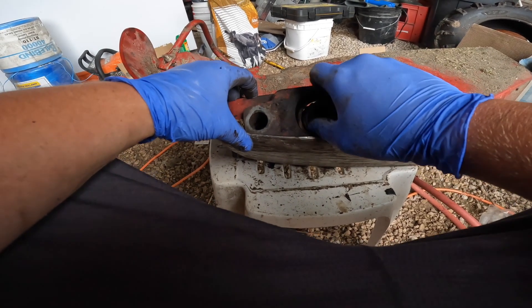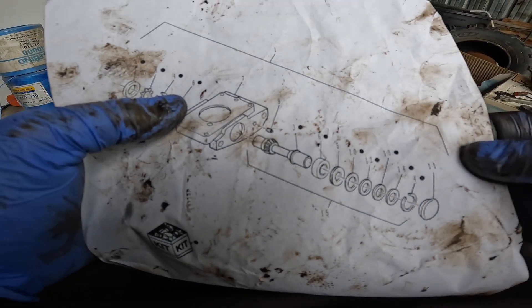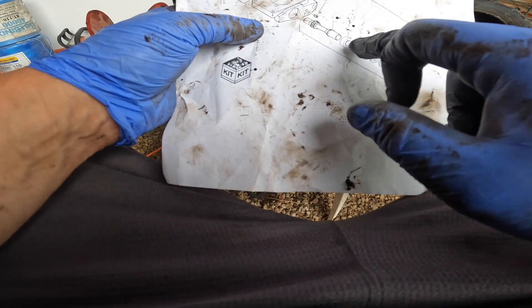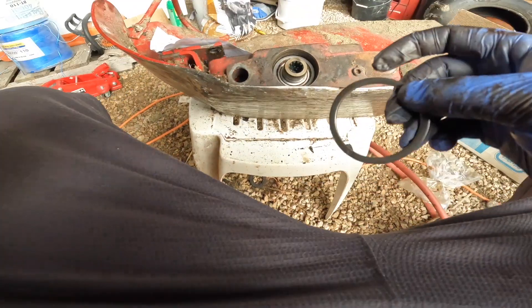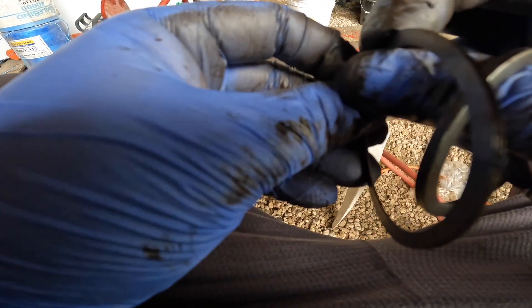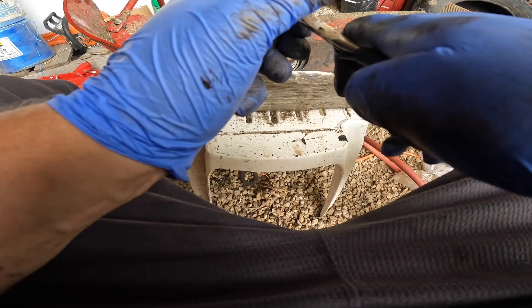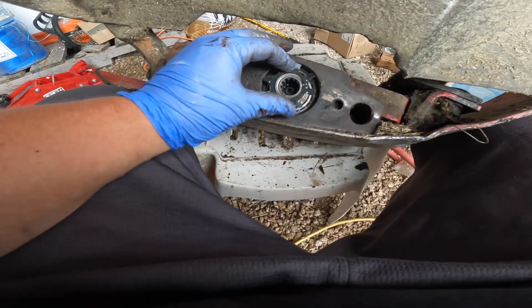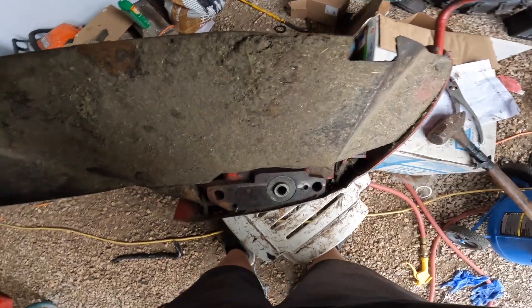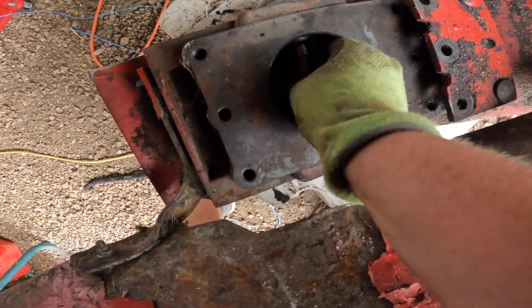It's good to go. I noted that items 5, 10, 12, 13, and 14 all look like washers, but actually only 5 and 10 are solid washers — 12, 13, and 14 are going to be shims. What I mean by a shim is they're very thin, narrow little pieces. This is what they call a washer — it's thick — and then there are three shims at the end, very fine thin pieces of material. This was the hardest collar to put on; I suggest having a special spanning tool to appropriately spread that collar.